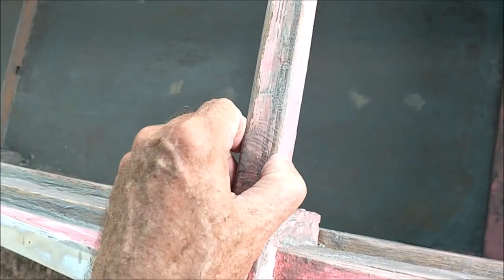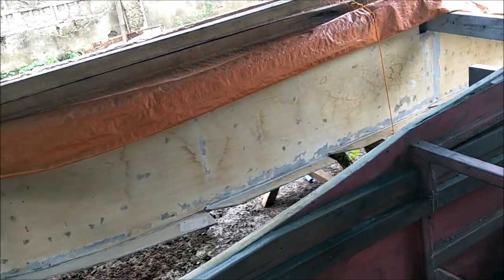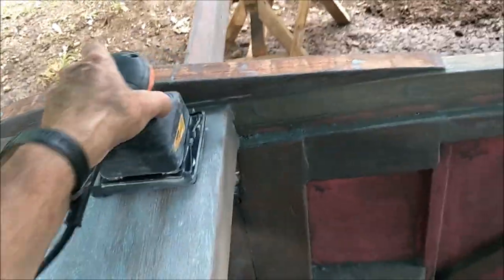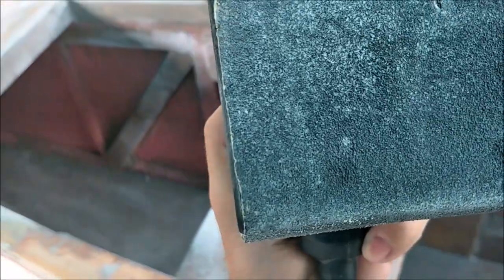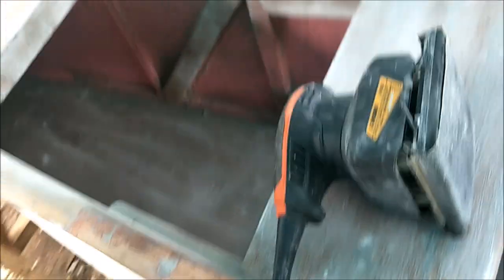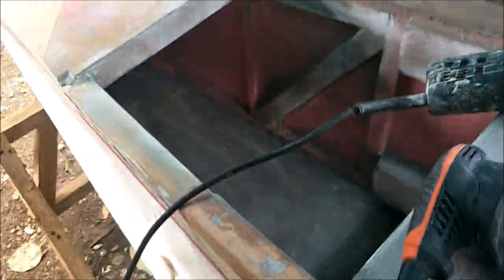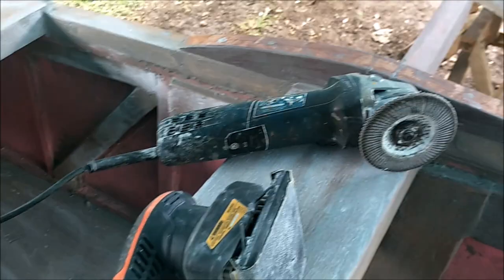You want a smooth surface on the wood so things don't scratch your hand or snag your bathing suit. I've got to do a lot of work on that hull — we did a lot yesterday and we're almost done there. I've got my handy dandy sander, using 60 grit. There's a nail right there — see that hole — when we nailed the extra plywood onto the boat, there's one nail in here. I just got the angle grinder on that now.